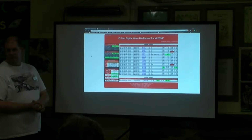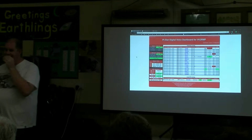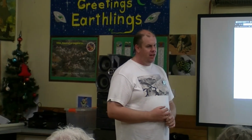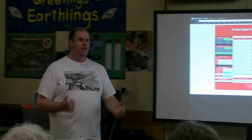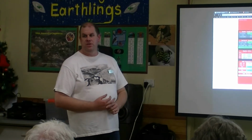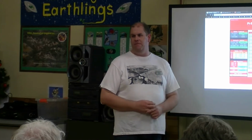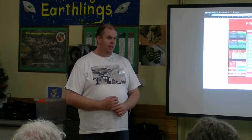I don't know, do we need to go through any configuration? This is a Yaesu Fusion repeater. Correct. How is it talking there? Right. So the MMDVM modem that I talked about earlier, I've taken it into the output on the back of the DR1 repeater. They're actually designed to be able to pull audio in and out. I actually haven't even lifted the case on that repeater to do this. It's just plugged into the socket on the back and plugs into the MMDVM modem. Brilliant design, absolutely love it.